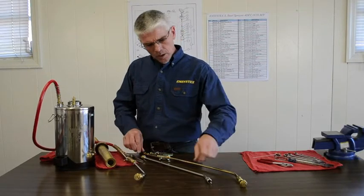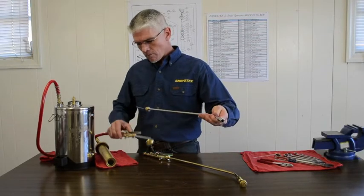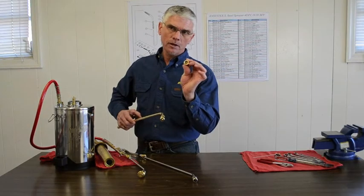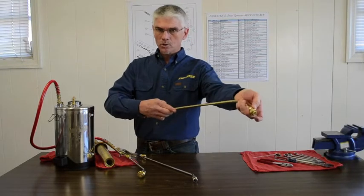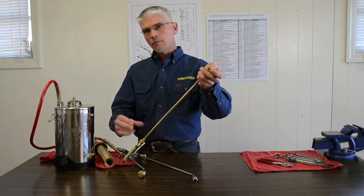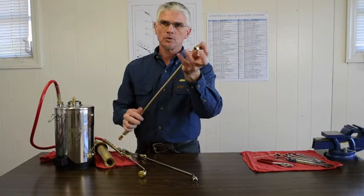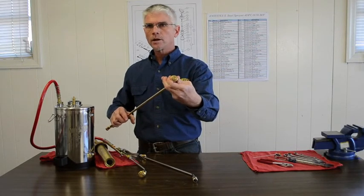So what's taking place is in the lance, or the barrel of the lance, we've got a cable that's attached to the valve. So when the trigger's depressed, that cable is pulled back and it opens up a valve seat that's mated and fitted into the back of the nozzle. So that valve is always going to be resting in its seat until the trigger is depressed. When we depress the trigger, we pull that cable back, we've allowed that seat to open and chemical to discharge. When we release it, it comes back to its seat. So this is always pressured, as long as there's pressure in the tank, all the way to the end of the nozzle.